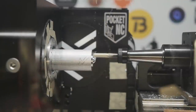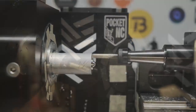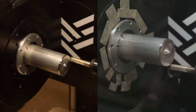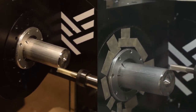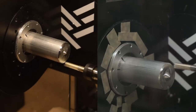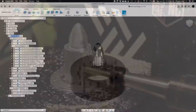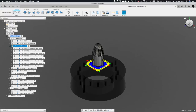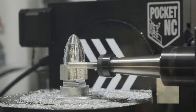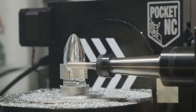Next to be improved were my adaptive roughing toolpaths. In addition to increasing step-over by 20%, I also experimented with feed rate override, and over the course of several dragons I ended up at a linear feed rate 25% faster than my original recipe. The toolpath was just starting to sound questionable, but those subtle vibrations never devolved into pure chatter. The worst part of these toolpaths were the little arc moves clearing material underneath the fins. I decided I was better off using plain 2D contour toolpaths targeting sketch geometry to slot away that material. That meant four adaptive toolpaths became two, and 97 minutes of roughing became 50.